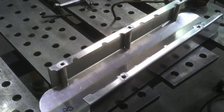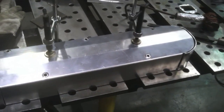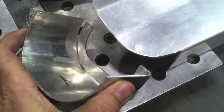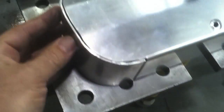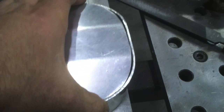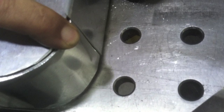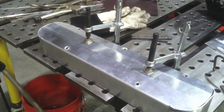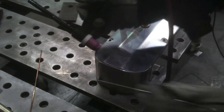I've got the frequency set to about 150, which really focuses the arc. So after doing all those, it's time to — and again, I'm not using the proper fixturing for this. There's fixturing designed to hold that mating surface flat. I'm just trying to work through the fit-up and tacking and give some feedback on things I notice. So the fits aren't going to be perfect, but this is the outside corner joint, and I've got it kind of clamped down, getting ready to tack the end pieces in.